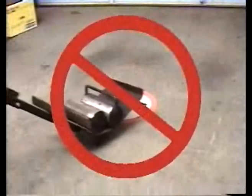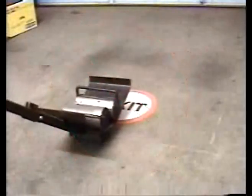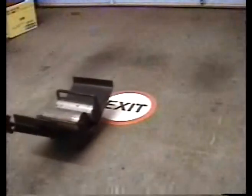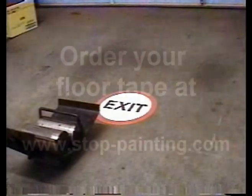Tamping is very important. Do not twist or turn the tamping device on the tape. Step 8. Make three passes back and forth over each part of the line. Make sure all edges are firmly adhered. You may open the area immediately after tamping is completed.